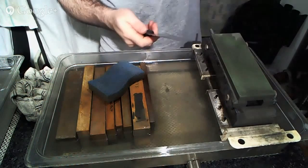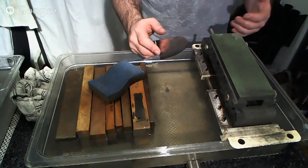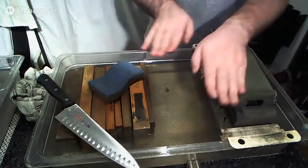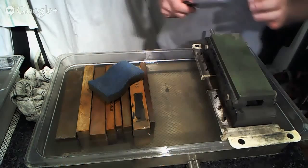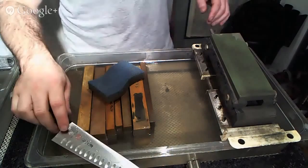Now, I just mentioned previously about how I do the tip sharpening and how I don't do it the same on both sides. You could actually do the technique that I use on the first side of the knife on the second side of the knife if you want. But what it's going to require of you is to move your body to a different place. So here I can stand in front of the stone with the body positioning I talked about, where my feet are kind of placed like this, off to the side a little bit. If I want to do that rotational thing, I need to actually bring my body off to the side of the stone a little bit over here so that I can follow through that motion. I was a line cook for long enough that I learned that I want to move my feet as little as possible while I'm doing things, just as a function of economy of motion. So I'm not moving much when I do this stuff. I like to stay in the same place.